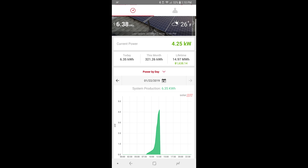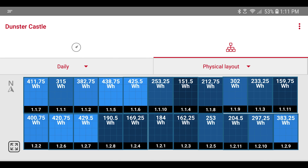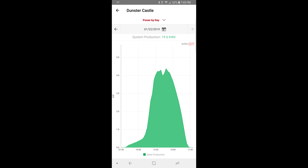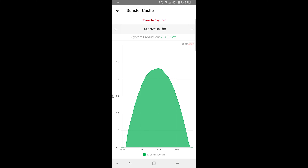The production ramped up pretty close to the max for the day at about four and a half kilowatts, and by one in the afternoon all panels were producing well. Later in the afternoon the panels were completely clear and producing as good as they can. Looking at the full production for the entire day, the beginning was pretty flat then it started to ramp up quickly — compared to a normal production day from a few days prior, which shows a more rounded bell curve as the sun rises with no snow on the panels.